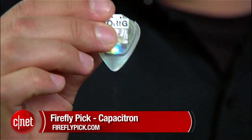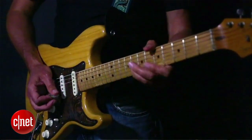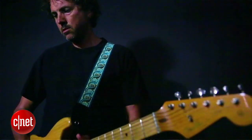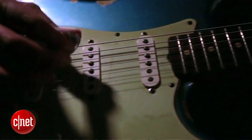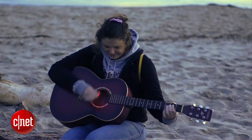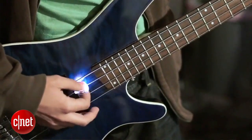This is a prototype of the Firefly LED guitar pick, and it actually has a built-in algorithm inside of it that learns your playing style. It's got an accelerometer in it which senses playing motion — either picking or strumming, fast or slow — and the accelerometer drives the bank of LEDs in it. That creates a link between the lights and the music being played, and with nearly instantaneous response times it can dynamically adjust as you slow down or speed up your playing. The flashing of the light follows the rhythm of the music pretty smoothly.